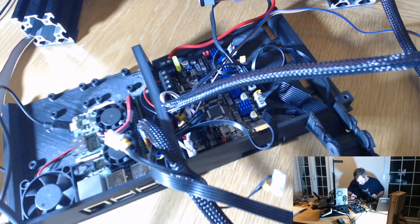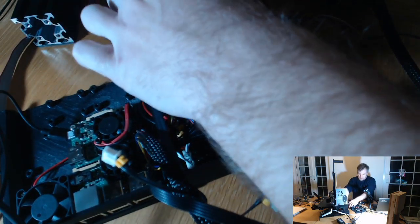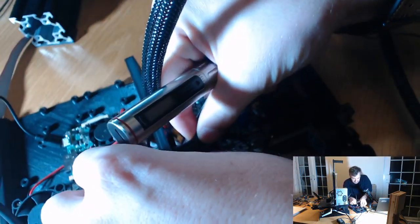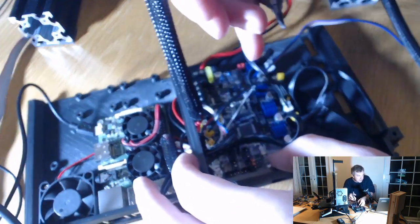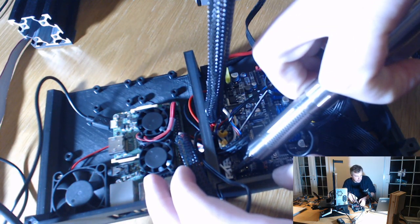So with that said, we can move to a second thing that was. Oh, actually, I'm gonna address one more thing. When I was connecting the hot end, so the hot end connections are, mind this mess in here. So can you see it? Maybe. So this is your first slot in here. This is your temperature for hot end, the thermistor for hot end.